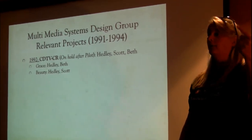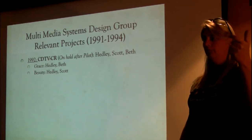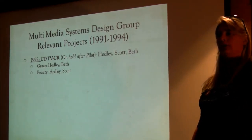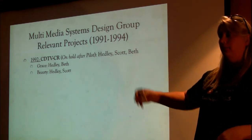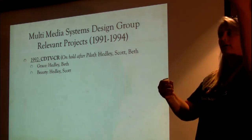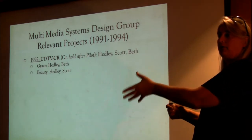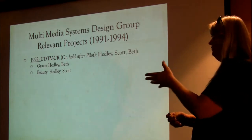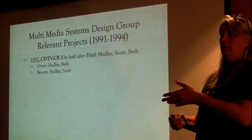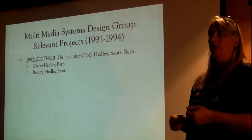Things like Gayle, Budgie, Gary, Buster. They're the bridge chips that put the processor bus and the chip side bus together. So traffic coming from the processor gets through the G and B chips to get to Paula, Agnus, Denise, the chip RAM, all that kind of thing. They're basically the traffic cops. In modern technology, they would be called North Bridges.